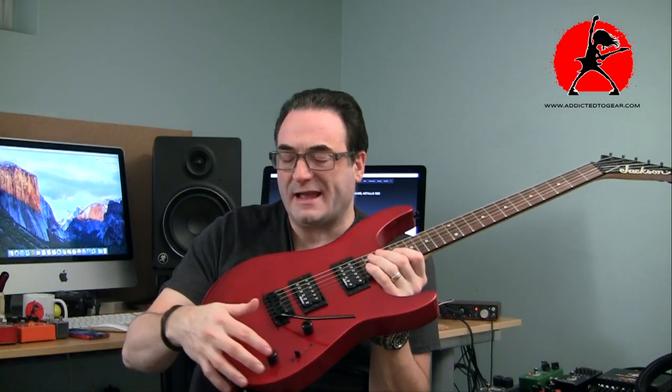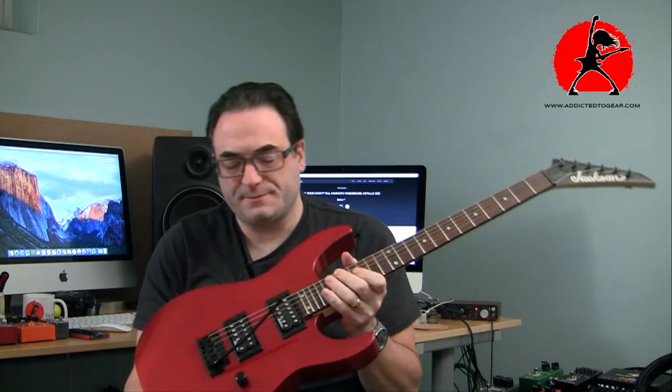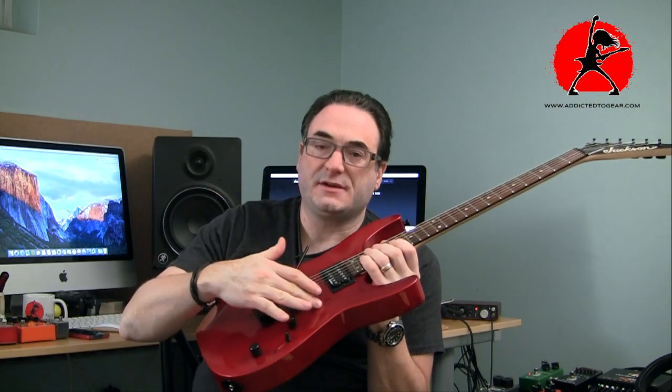When I'm installing pickups on my guitars, I always take the time to swap out the electronics, because these overseas guitars always have mini pots and the switch is not high-end at all. I just take them out, throw them away, and put in CTS or alpha pots depending on what I have lying around, along with a Switchcraft switch — just to give it more durability. They won't crackle, and the taper on the volume and tone will be a lot better; they won't just go from zero to ten in a quarter twist.